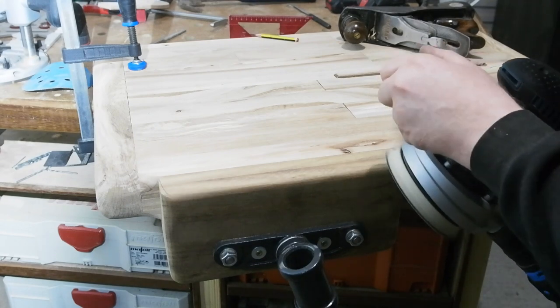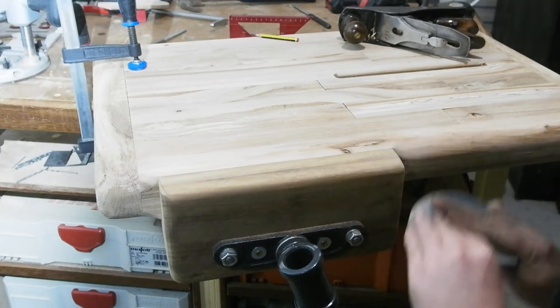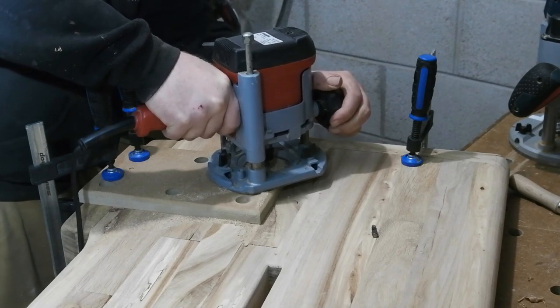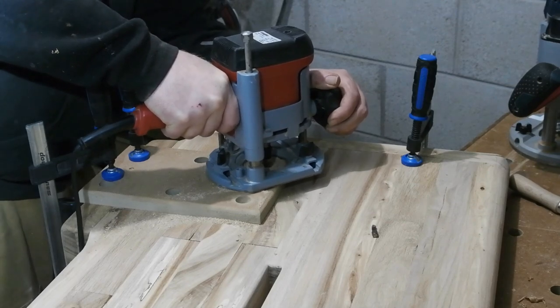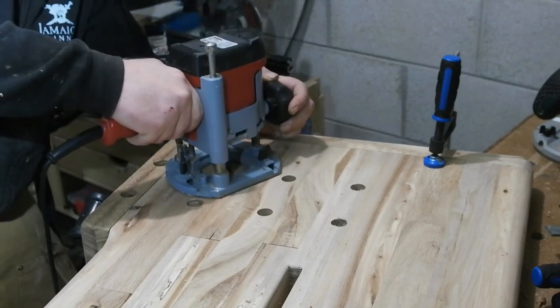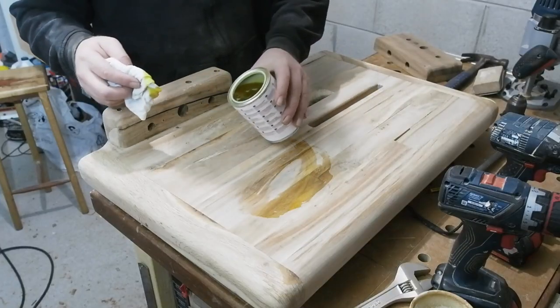Vice jaws flushed, I just mark the edges top and bottom for a tapered round to continue the soft and thin look. A random orbit tool makes it quick, then a few strokes by hand to finesse it. For the dog holes, I'm using a scrap piece from an old MFT top as a template, with a bearing-top router bit. The holes go about 25 mil deep, not right through, as the vice will be mounted directly underneath. Then I finish the holes with a light chamfer.